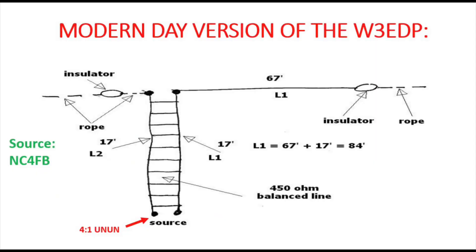Since then, the antenna has sort of morphed in terms of its design and gone through one or two changes that have become the current vogue in terms of how it's put together. The modern-day version of the W3EDP is basically a 67-foot radiator, but instead of having a counterpoise, we've got the antenna fed with ladder line. That ladder line comes to a length of about 17 feet, and at the source at the bottom, we tend to have a 4-to-1 unun connected to the ladder line. The hot side is connected to the unun and goes up, joined to the 67-foot wire — so in effect you could argue we've got an 84-foot radiator.